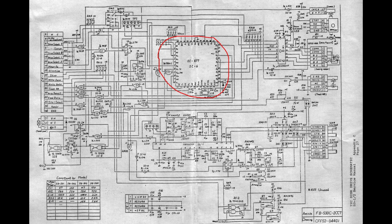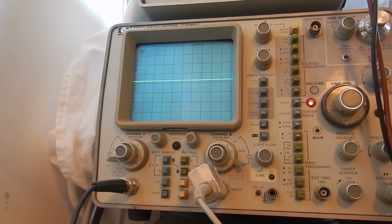Now, on the FB501 drive, all motor and stepping functions are handled by a little microcontroller unit. So, to understand how it's driving the stepper phases, I can only check with the oscilloscope or the multimeter on the motor wires. I'm checking 2 wires at the same time during a complete disk read. What we can see is that 2 phases always vary their voltage at each full track step. I'm trying all possible different wire pairs.